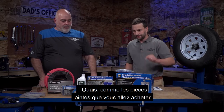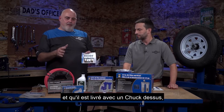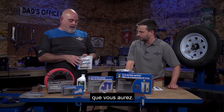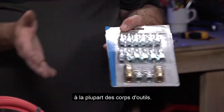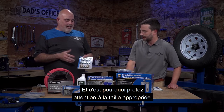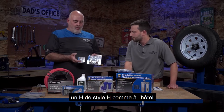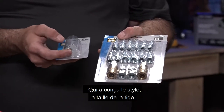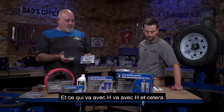Now the fittings. Most people have seen these. When you get a tool or buy a compressor, it's going to come with an M style fitting - M as in Mary. That's the most common style, typically quarter inch, can get them in three eighths. It fits most tool bodies. When you get into larger tools they might take a larger size. I also have an H style fitting - H as in Hotel. The letters designate the style, the size of the shank, and the size of the orifice inside that delivers the air. You have to match them: M goes with M, H goes with H.